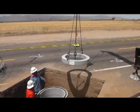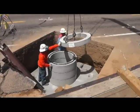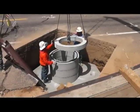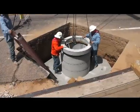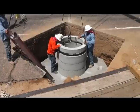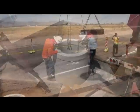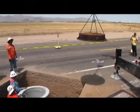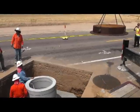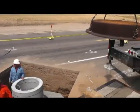Here comes the last ring. As you can see, it's thinner than the rest. That is because they need to use a thinner one to match the top of the manhole with the top of the pavement. Unfortunately, in this situation, this ring did not match the top of the pavement. So they're going to take the top of the manhole, which you can see here, and lay it off to the side until they can get the appropriate size ring to match the existing grade of the pavement.